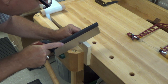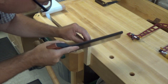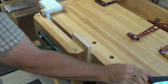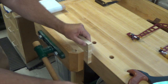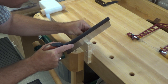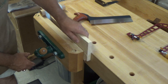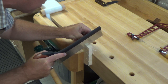Don't kid yourself — there is a bit of a technique to this. I know I look a little awkward doing it and I'm okay with that because I know over time I will improve. So we've got our seven-degree angles cut. Now I like to flip it over — we have this outside edge piece that we scored — and again you want to be on the outside of that score mark, and just gently cut down until that piece pops out. Flip the board over and do the other side, again using your thumb to line up the saw to the edge of that score mark.